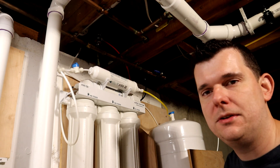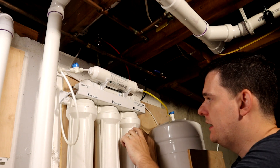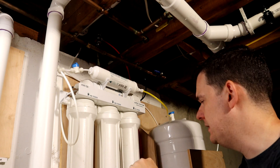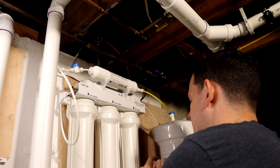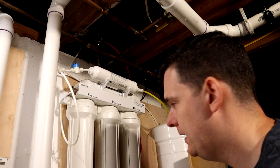You can open up your tap and that will relieve a little bit of water, but you're going to make a little bit of mess as you take these filters off, and that's okay. If you're underneath your sink, just put a rag down — you're going to get some spill water out of these cylinders even if you're really careful. The first step is to take our spanner wrench that comes with the kit. Hook it alongside and remember we're going to go clockwise in this case.